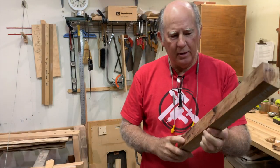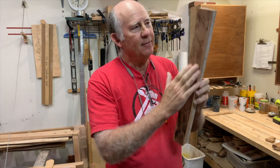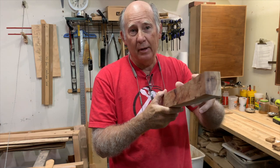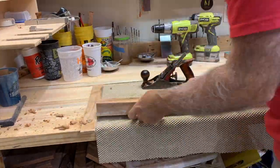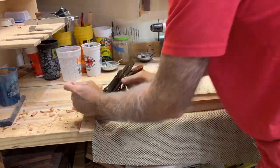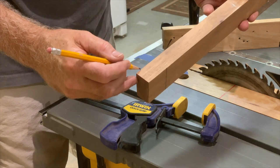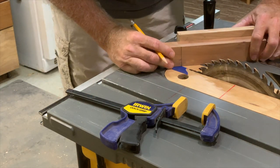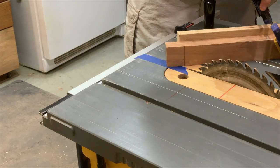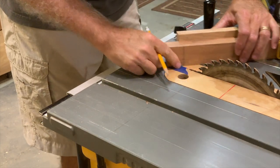I got a reasonably good cut, but the board slipped and it ended up being a little tapered. So now I'm going to have to hand-plane this to get it flat — as long as I can get this surface flat enough, I can come in and cut the other side parallel. I drew a line straight down here — that's going to be the inside of the 45-degree cut going out that way. The cut needs to be right on the line, but I'm going to move it just inside to allow a little extra room to sneak up on the cut and get it precise.